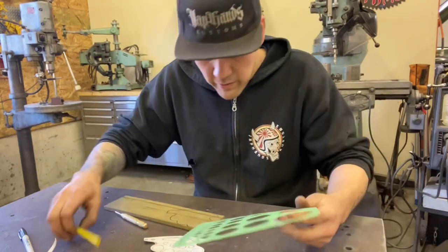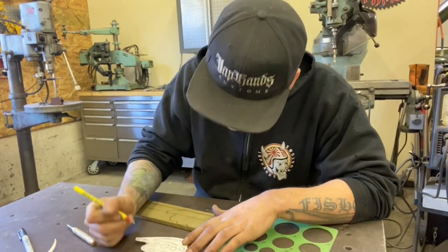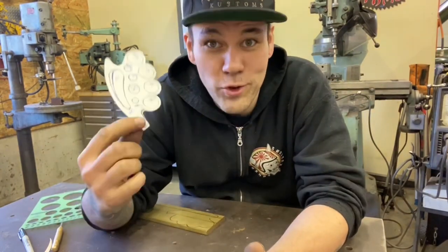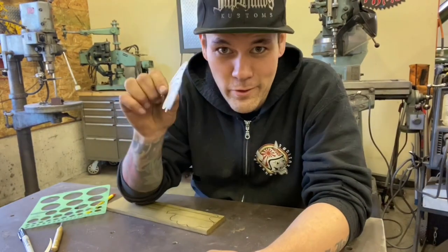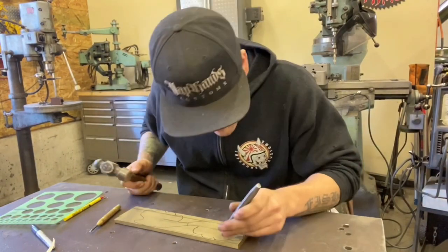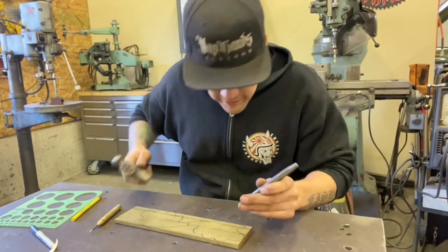Now what size are all these holes? I'll mark them down on my template. These are 15/16, these are 7/8, and these got 3/8. Here's another little plan - I'm gonna make two of these, and one of them I'm going to give away to one of you subscribers in the first month this video airs. Hit notifications so you can see what we're making every week. I'm going to go over the punch marks a little heavier sometimes just to be sure - this stuff isn't cheap and I don't want to mess one up because a drill bit skipped out of the hole.